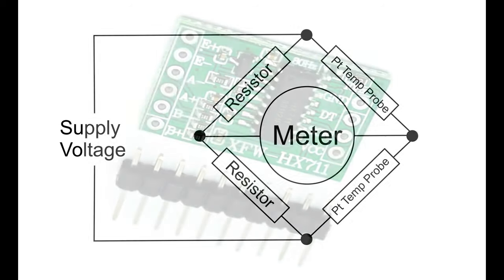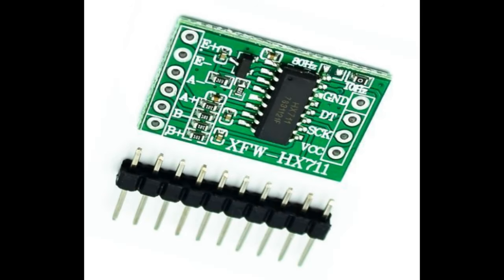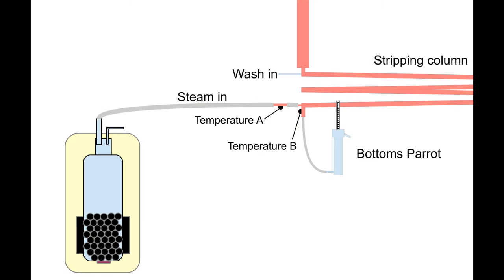I point out that there is another widely and cheaply available system that uses an exactly comparable measurement scheme to measure the difference in resistances between the strain gauges of a load cell — that is the HX711, which can be bought for a dollar or two. If we were able to measure this A-to-B temperature difference with enough resolution, that could act as a sole control parameter for the column. That's because of a continuous relationship between the column bottom alcohol content and the operating conditions. When a column is weeping, the bottom alcohol content will be high and the temperature difference large. When a column floods, the bottom alcohol content will be low and the temperature difference small, and the optimal point will lie between these two. For a specific wash flow rate, it should be possible to plot a relationship between the bottom temperature difference and the product proof, and once plotted, an optimal point can be found and used as a control target.